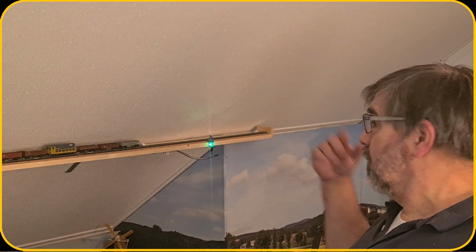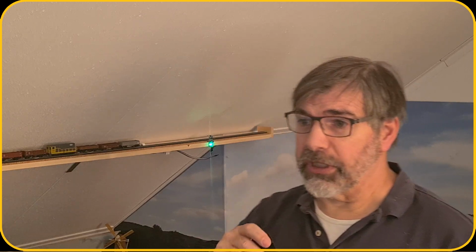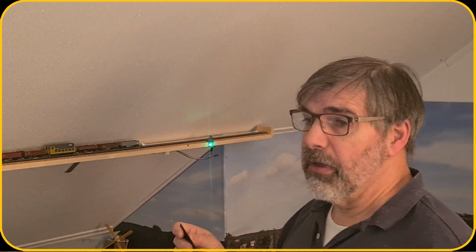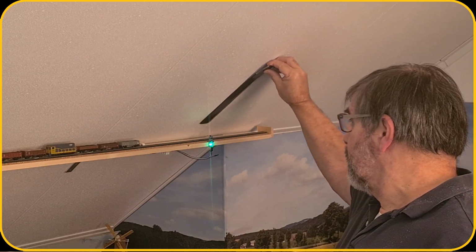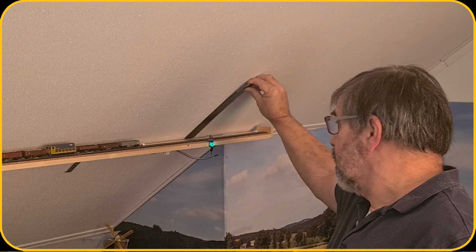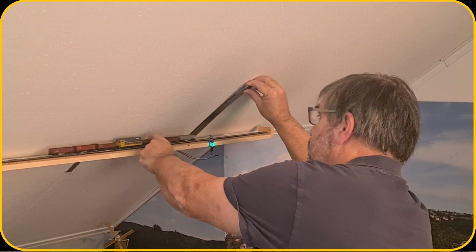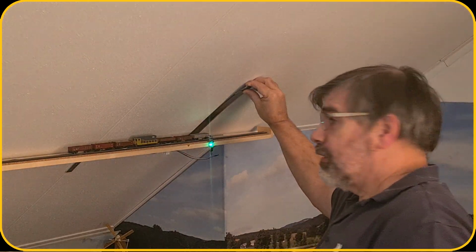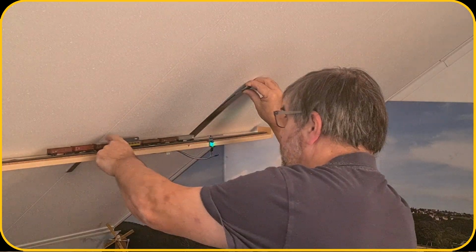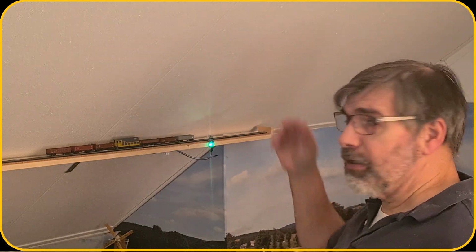And what I'm gonna do, and I mentioned that already, I'm gonna add a black stripe or a darker stripe of paper towards it, because I can show you that with this straight edge, which is black. If I slide it here, you see that the light goes off. And when I move the train, the train is detected. Now the train is not detected, and if I remove that, the sensor thinks that there is still a train,